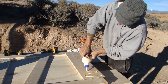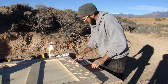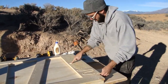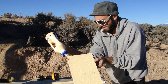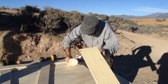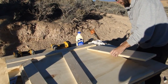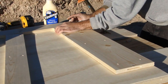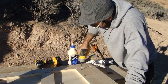So begins the lamination process. You want to use a generous amount of wood glue — put it on liberally on the wood and then spread it out with a brush or your fingers so it's even throughout the entire face that you're gluing. This will maximize the gluing surface and strengthen every joint. You also want to be pretty liberal when applying glue to the butt ends of the wood where the biscuit joints are going to be, and make sure to put a good amount of glue into those biscuit cavities so when you push the biscuits in the glue squishes out and makes a really solid connection. Make sure when you're setting the pieces on the plywood and to each other that you're pushing really hard, there are no gaps, and hold it tight or have someone help you when you start screwing them in.